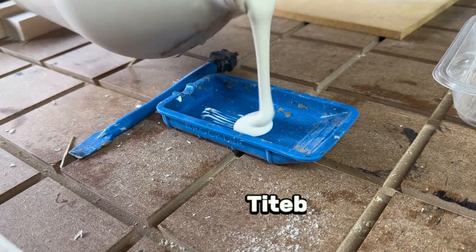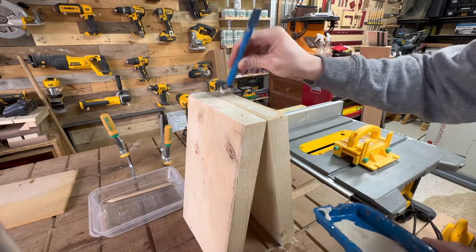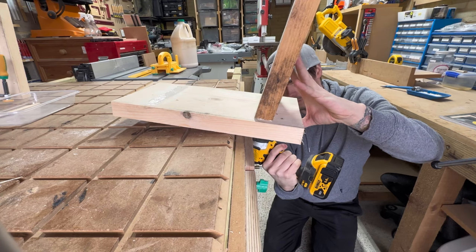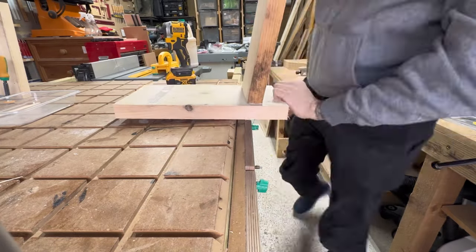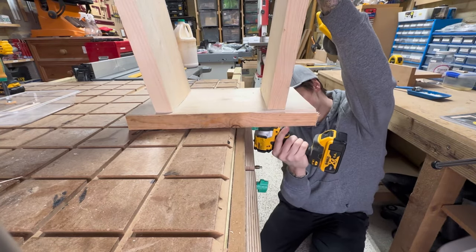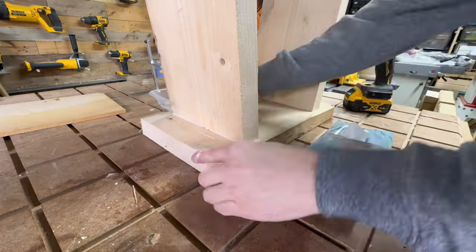Now it's time for the glue up. I use Titebond 3 here. First apply glue to the underside of the stool top and then move on to the legs. End grain absorbs glue at a rapid rate, so it's a good idea to apply a layer, leave it a minute or two, and then reapply a second layer. Now we place our legs onto the stool top — you'll know you've got them in the exact position because the screws slightly protruding from the underside will fall straight into the pilot holes you've drilled into the legs. The double washer anchor system means you can be slightly more aggressive with your driver, pulling the legs tight to the base. Using screws over dowels means you can continue to work without waiting for the glue to dry.